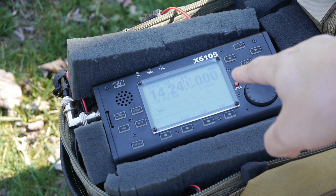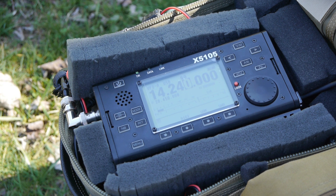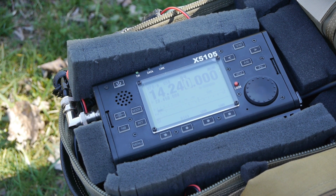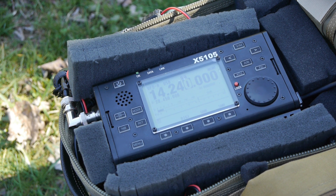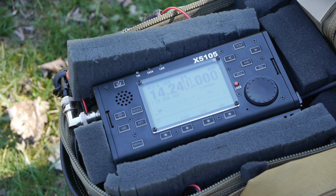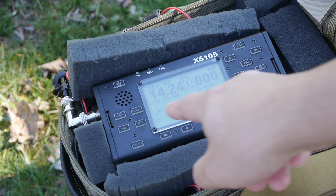We have 20 meters going. We're receiving a station from Rome, Italy — IK0 ETA. I tried contacting him a few times but couldn't make it, and that's okay. Just a short demonstration of what you can receive with this kind of HF setup right in the front yard. We're using a 40 meter EFHW halfway on 20 meters, so you can use it on both bands when you do it right. We're here in New York and we're getting almost S9 on the scale.